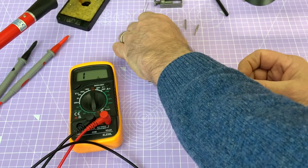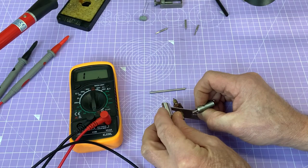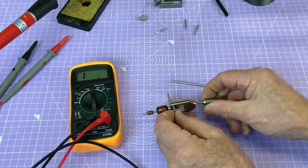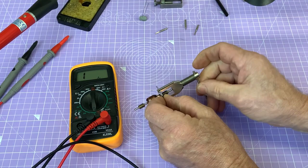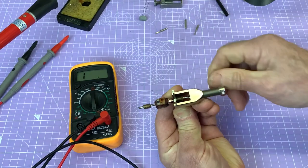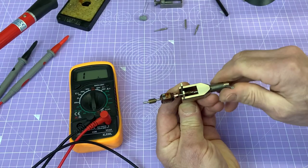Very handy tools, these worm pullers. So I'm going to insert that part, the mandrel there, and then you'll have to forgive me if I'm fumbling a bit, because I'm trying to maintain this in shot as well. So I'm now going to fit this. Now I'm well aware that the mandrel I'm using won't go through the worm, but it'll be enough to get it started. So I'm just going to take the tension up. How can I hold this? Hopefully you can see, and yeah, we should have movement. So I'm gently just using the tool. I'm going to push this until I'm more or less level with the worm.